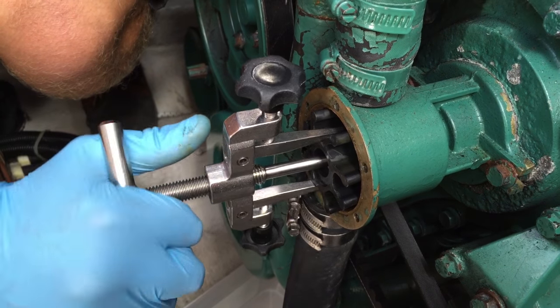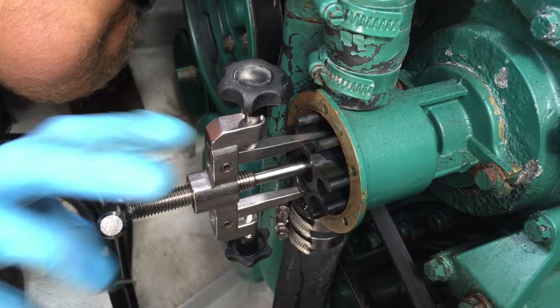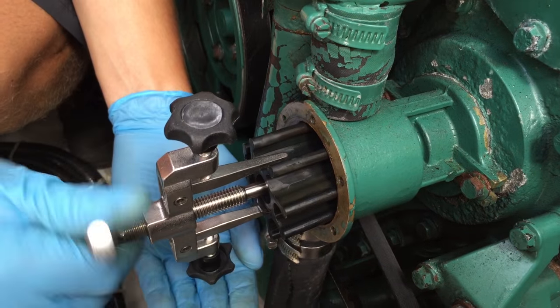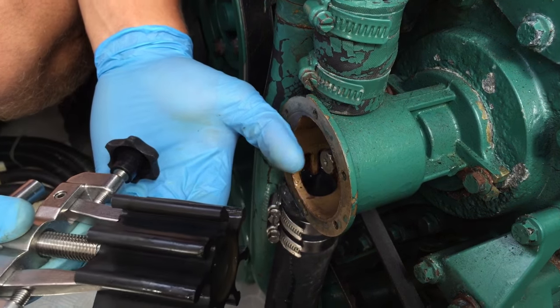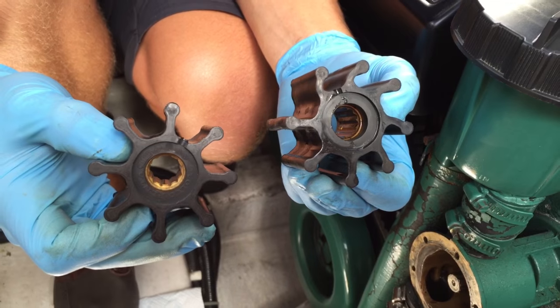If we'd had a proper overheat, the impeller might have come out in several pieces. The good thing about having a filter after the pump is that any broken impeller bits would be caught in the filter. Really smart boats have a filter before and after the pump. Kieran's got it out beautifully — just a little pull and the whole impeller is out. And this one is actually in really nice condition, so it wasn't the impeller causing the problem.